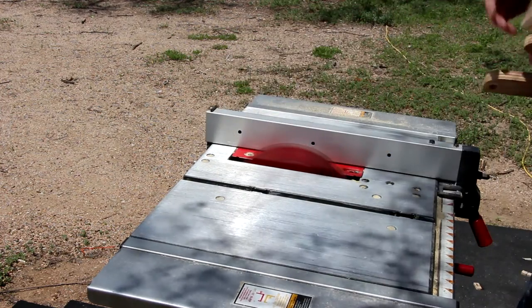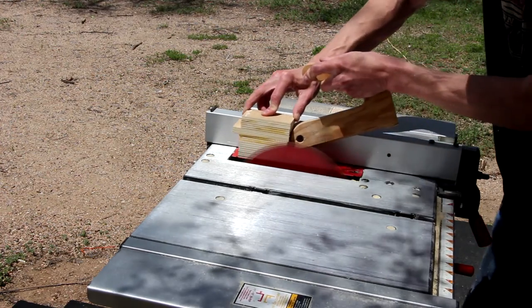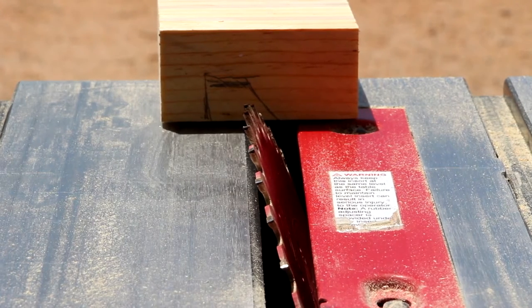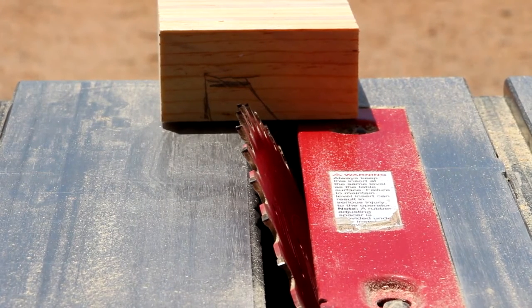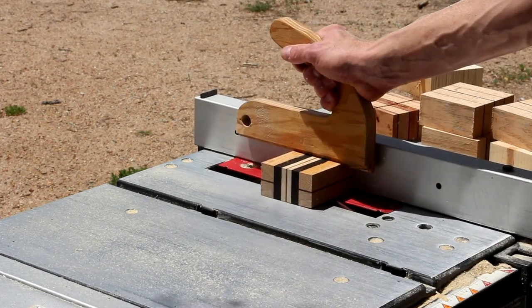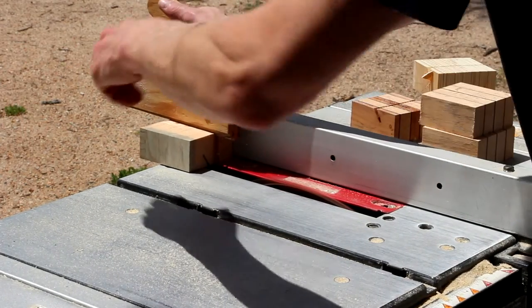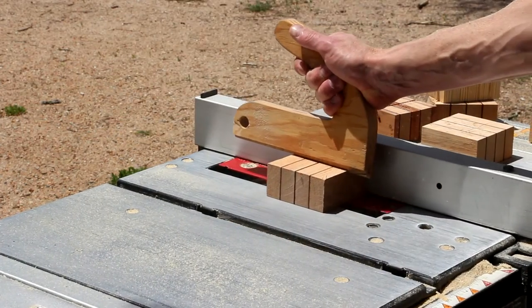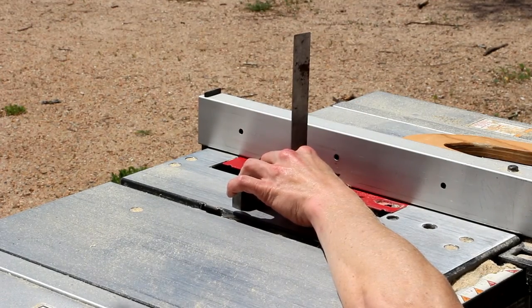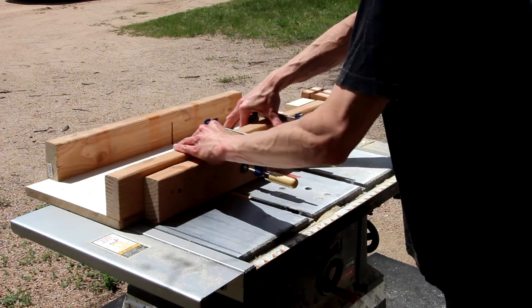This will even up some of these rough edges on the top. I set the angle on my table saw to be about the angle that I want these cards to sit. Then, using my rip fence, I just cut the angle. I make sure my blade is at 90 degrees, then go back to the cross-cut sled and cut the slot. I'll just batch these out.